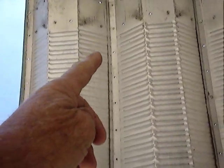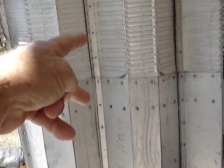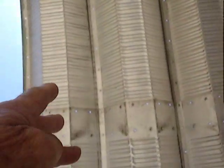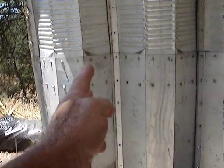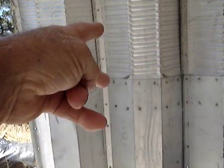You do this pre-disassembly — you take all these bolts out. You've got to leave a couple in here to keep the structural integrity together. Otherwise, when you go to undo these, this piece would just be sitting with nothing to hold it. It wants to twist around and twist out.